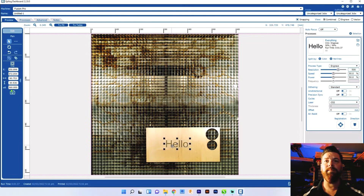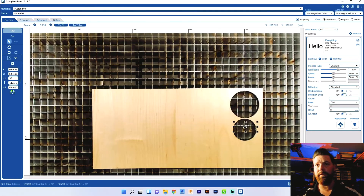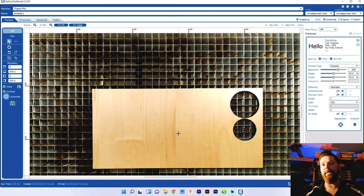If we want to, we can even use these circle guides. We can make a 40mm ring and cut a little 40mm circle. We drop it into that slot, set this tag to say 35mm, move it over and align it to the centre. Then we're ready to etch inside that 40mm ring. If we put a little disc inside of it, the word 'hello' goes straight on top. Put the design on there as a little guide — this is cool.